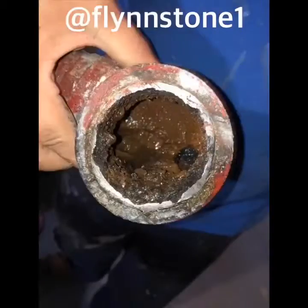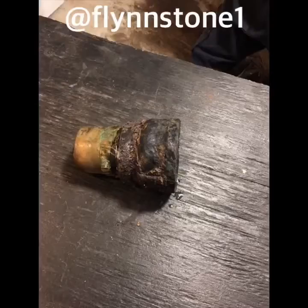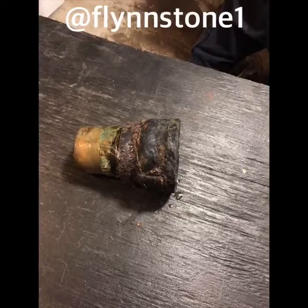That's when you're going to see brown, murky, sludgy water in the boiler, and you're going to want to recommend a re-pipe. Here are some pictures from steam boilers that have been piped in copper — either on the riser, header, or equalizer. The brown and black discoloration is from the electrolysis.